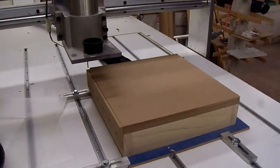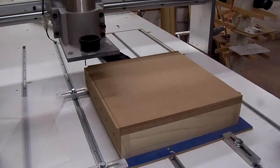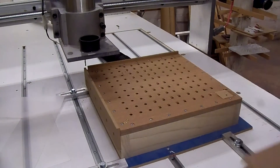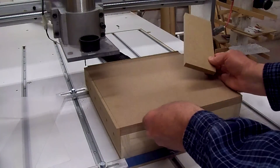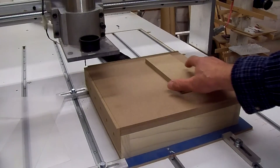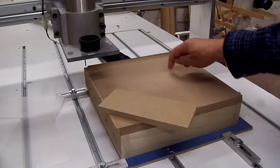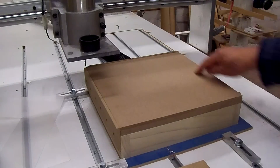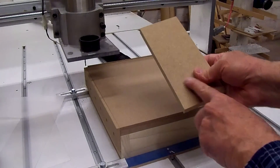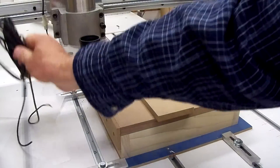So I'm going to try to do it on my vacuum fixture on the CNC to cut out the holes and do the rabbets on both ends. But before I do that I have to make a template to go on the main fixture just where the part will fit with the vacuum holes just under the part. I've already got the program G-code made to route out the holes and also put a groove around it just inside the edge of the part, and use some of this gasket material to make a seal around it.